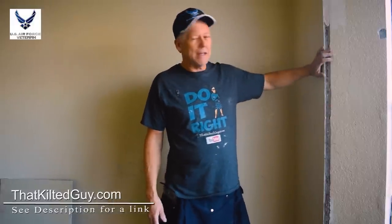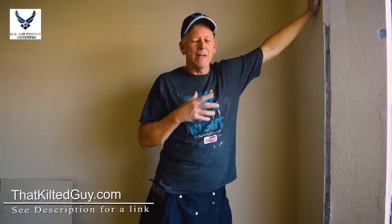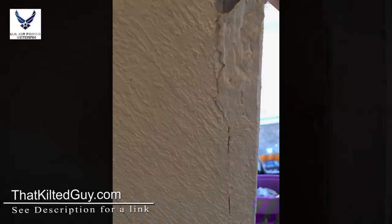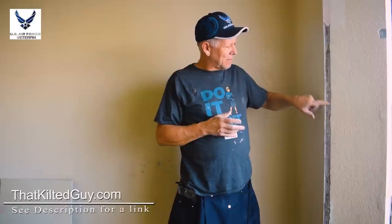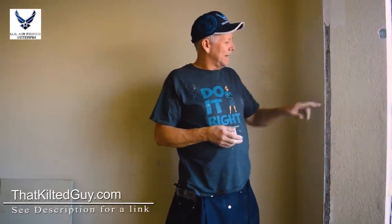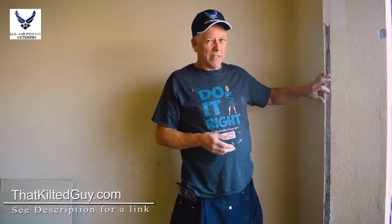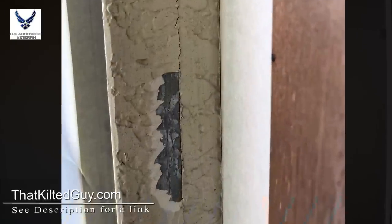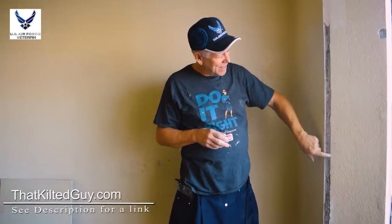Now to get started — I'm on a big job here, an apartment that's been rented for quite some time and beaten up pretty bad. There are quite a few corners like this. What causes this: number one is the metal corner bead — sometimes the mud just doesn't stick that great. Under normal circumstances it'll usually last a long time, but in an apartment where it gets beat up, run into with furniture, the mud may pop loose or crack. You'll often just see a crack along this edge and sometimes it'll flake off in little bits and pieces.